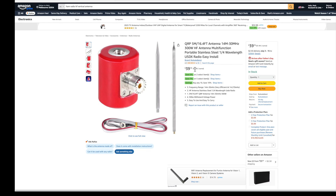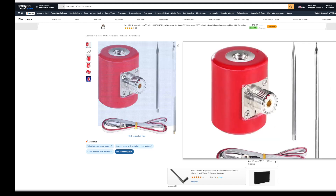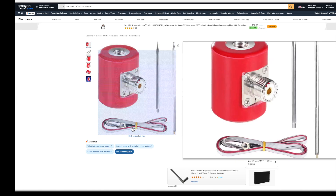I think that's a price drop from the last I looked at it. You have your insulator here with an SO239. This is a steel spike for sticking into the ground, and this is your whip, which fully extended is a quarter wave on 20 meters. This ribbon cable down here is supposedly your ground radials. I don't think there are any instructions that come with this.